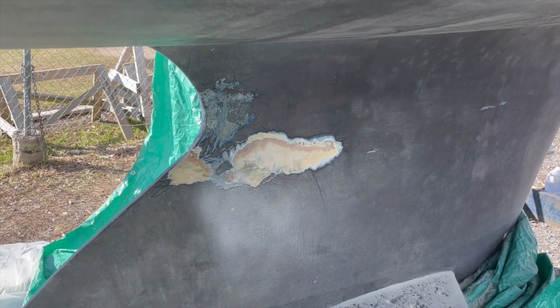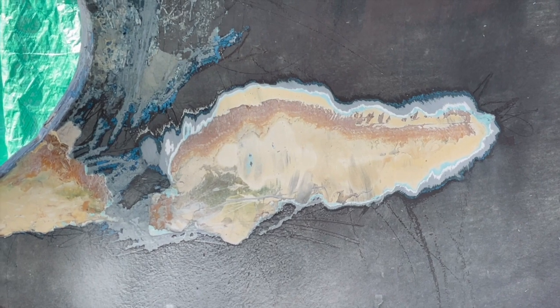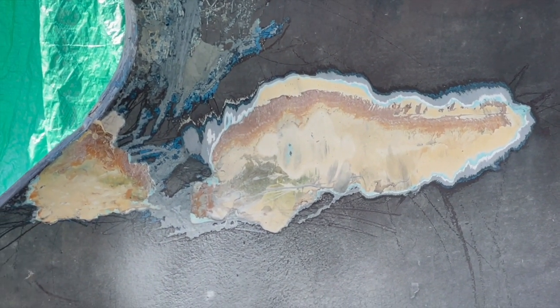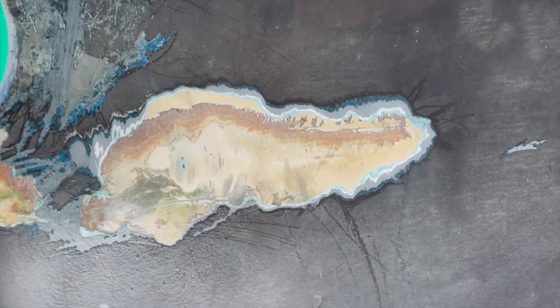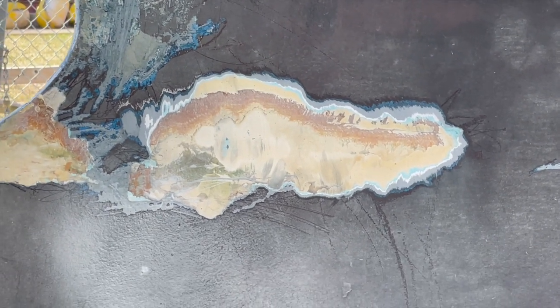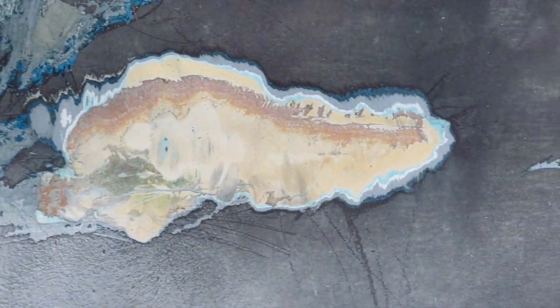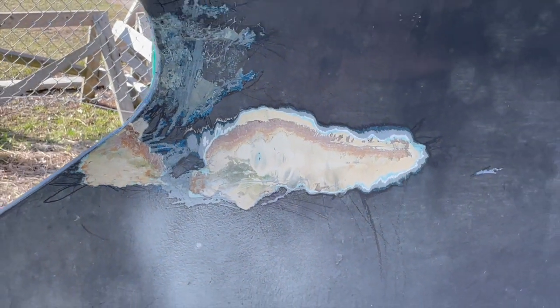And after chipping at it just a little bit with your fingers and a little bit of a screwdriver to catch the edge, this is what you get. Now, I'll show you what it looks like on the other side. So this is after the initial little grinding there to see to where this goes. And as you can see, the back part is not ground yet, but the front part has. So we did not find anything past this that was not glued or delaminated, which is a good thing. So at this point, we're going to leave that front part alone, and we're going to start cleaning out the back and see to where we're going to go. So we'll show you the end result after all the sanding.